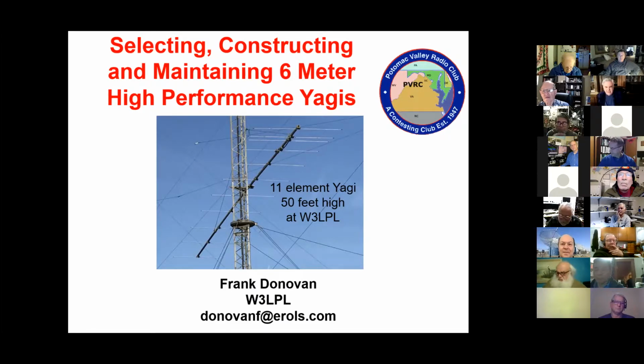On this 11 element Yagi, the space between those two parasitic elements is probably roughly about 6 feet, and the tower is centered in that space. It might even be more like 8 feet. But you definitely never, never, ever want to put a parasitic element for any Yagi on any band within less than a foot of a tower face. You might get away with it with Rohn 25, which is a small tower, but you put a parasitic element that close to the tower face and it gets detuned. And it's not detuned by parasitic effects that we're familiar with modeling. It's actually eddy currents. It's eddy currents that cause problems with parasitic elements very close to booms, and it's also eddy currents that detune parasitic elements that are very close to a tower face.